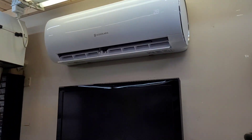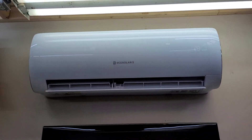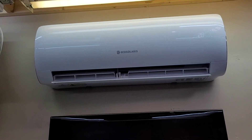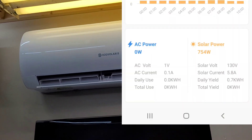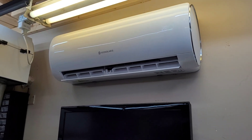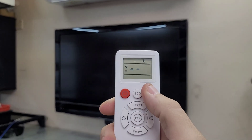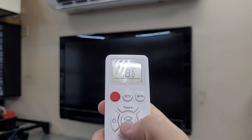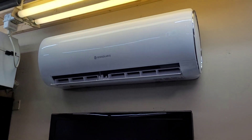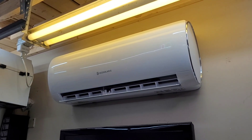We've been running a little over half an hour and we're up to 27.5 degrees Celsius in here — definitely pumping out the heat pretty well. It did shut off on me one time, but other than that it's been running pretty solid. We peaked right around 730 to 750 watts. I'm going to flip it over to cool now using the remote, set down to 17 degrees. Just like the EG4, there's a two to three minute changeover delay, so we'll give it a minute to get sorted out.